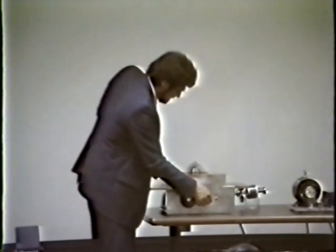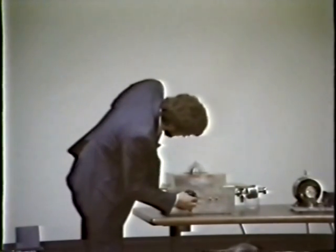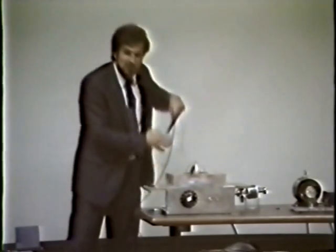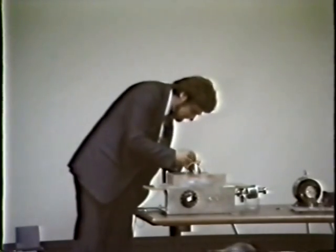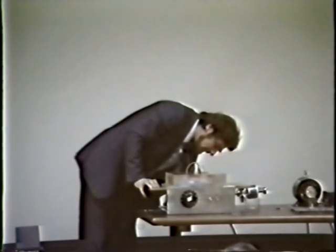So I'm going to reverse it at some reasonable speed. [Fuse blows.] But a good engineer always has a spare set of fuses — I made sure I had about three of them. When we were making this, we found that this reversing switch shorted because the transient was so high, so we had to get one with a higher rating than the one we used originally.